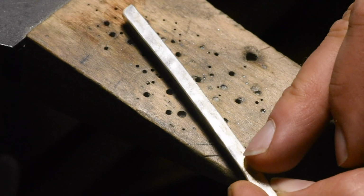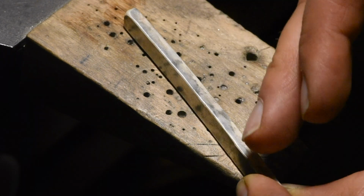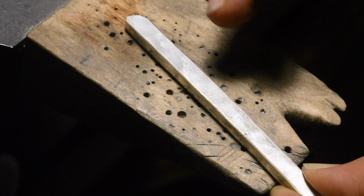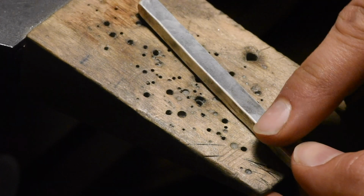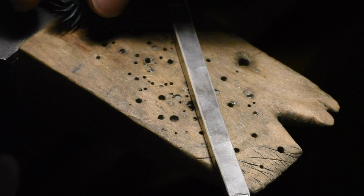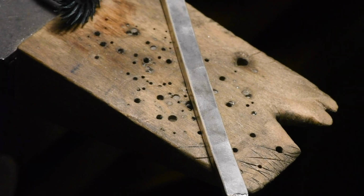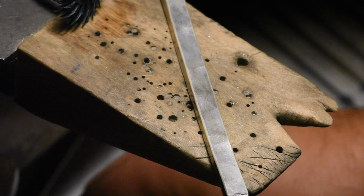I kind of have a little metal coming up here. It's flaking up, which means that there's some stress fracturing here. So I'll probably grind that down real quick after, maybe before anneal. Probably grind that down just so that it doesn't keep fracturing out. It's just nice to get some of your grinding done before the problem gets too bad.